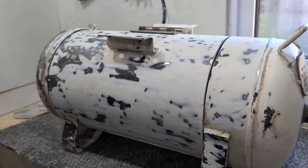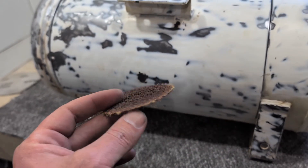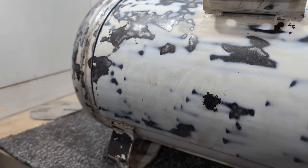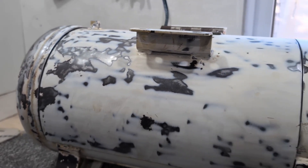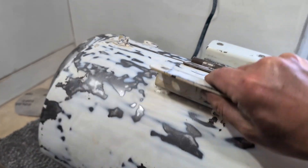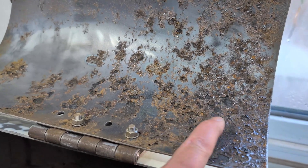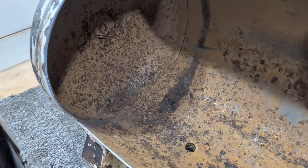I've been giving it a bit of a flat off, trying to get this thing tidied up and it's absolutely destroying me. I thought it was going to be quite straightforward. I've been using some surface conditioning discs - these are 3M ones and they're actually putting a reasonable finish on it. But there's an awful lot of hidden corrosion. This white coat appears to be something along the lines of an epoxy high-build primer. You can see it's all built up in the edges - they obviously used that to cover up some of the welds. However there's an awful lot of hidden corrosion on here. Even this little bit here - that's fully rusty underneath, and there's some really quite bad pitting, which is a bit scary when you consider this was a pressure vessel. The pitting inside is way worse than anything I can clean up with the tools we've got here - you'd have to hit that with a big grinder, and you can't do that inside, there's just not enough access.